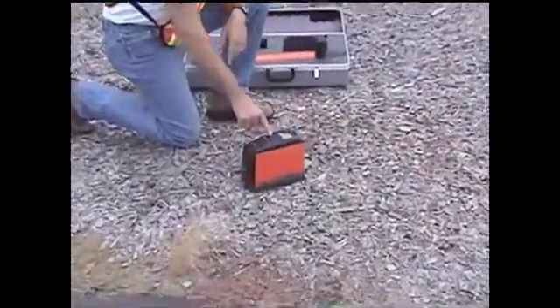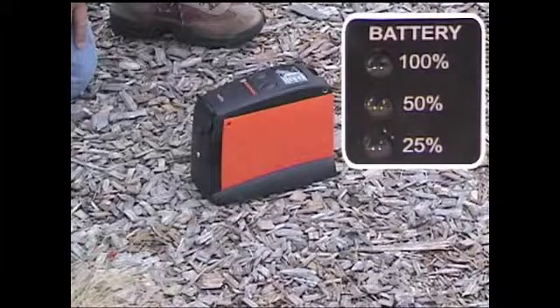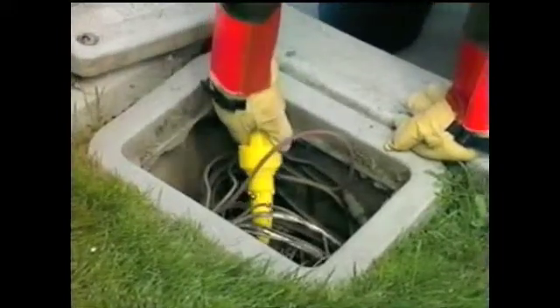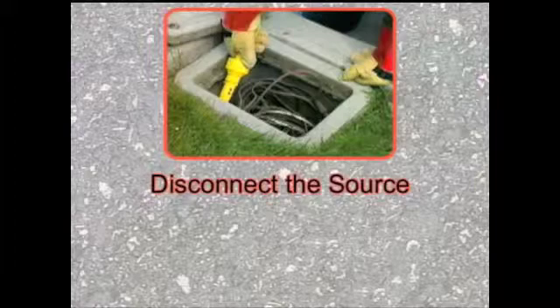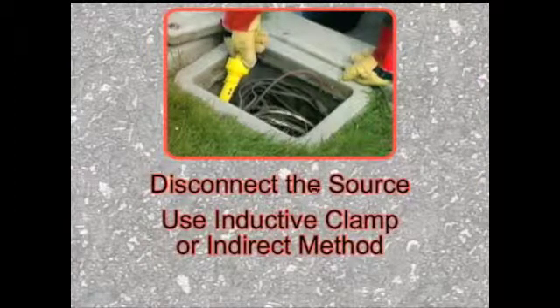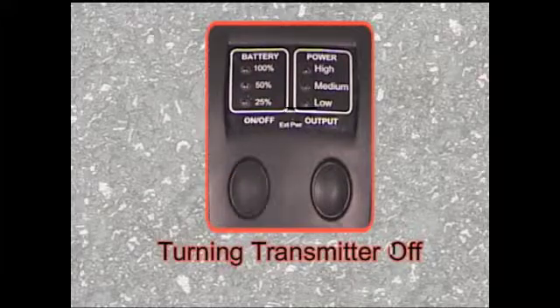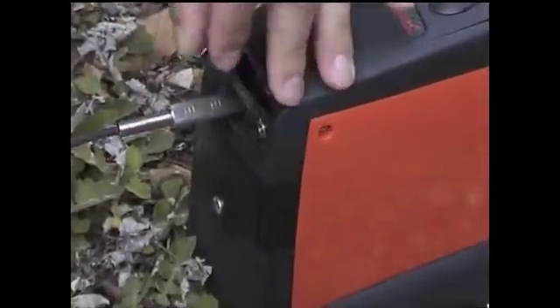On the transmitter, push the on-off button to turn the transmitter on. The battery level is displayed in percentage. A 100% number indicates the batteries are fully charged. All LEDs flashing indicates the batteries are very low. After checking the battery status, turn the transmitter off before plugging in the leads. Because pipes and cables may carry live current, use a voltmeter before attaching the transmitter to any conductor. If electrical current is present, carefully disconnect the source using appropriate safety procedures. If you cannot disconnect the live current, use the inductive clamp or the inductive method to locate your target. If you are using the direct connect method, make sure the transmitter power is off. Because of the 810DX's high power output, handling both leads with the power on could deliver a shock.